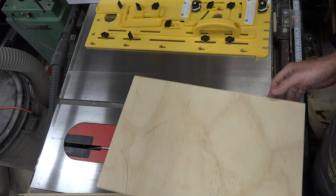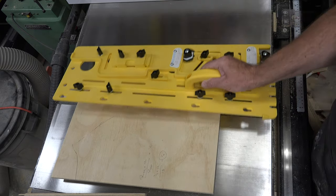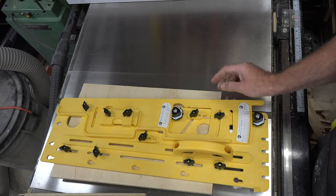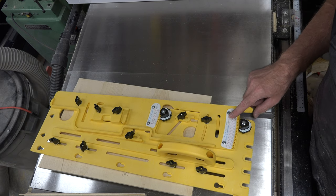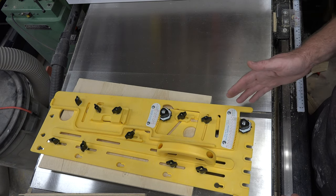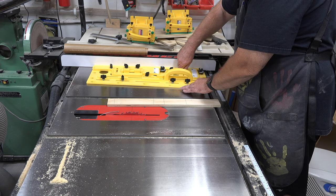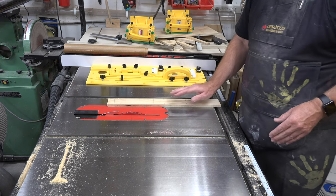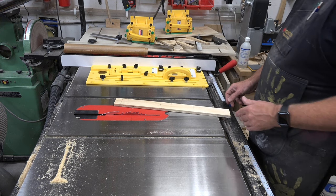So that there is the main functions of cutting the tapers. Three ways of setting this jig up for the tapers, both with rise and run, or if you prefer the angles, or setting it up by eye according to your miter slot. What if you want to cut something small like this, a 2-inch wide piece?